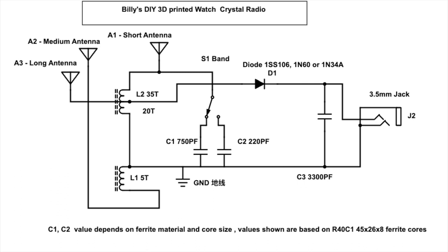You can also create a DIY crystal radio earbud using a piezoelectric buzzer. Just connect the two wires to the output of this crystal radio, then make an audio conduit channel using the tip of a ballpoint pen or similar object, and put a cushion from an existing hi-fi earbud onto it so you won't hurt your ear. There are many ways to create your own earbud or you can just purchase one.